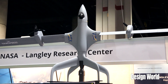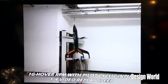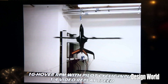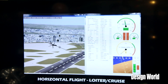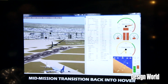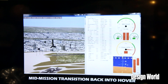The power for the rotor motor was the same power that we needed for long endurance flight, and we said well this is silly — let's make the rotor and the wing one, let's make the motor one, unitize them. So what we've done is we put the engines on the wings, we tilt the wings to convert them to a rotor, and we power the wings directly by the thrust of the propellers. There's no gearbox, no torque to ground, no tail rotor, and you just use the same engines you'd use for efficient long endurance flight to lift the airplane up when you use the full wingspan as the rotor.